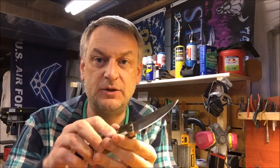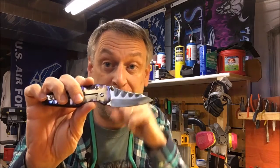What I usually do is I'll take a knife like this one, for example, and I'll use the shape of the swedge here, and I'll lay this down on the steel and just trace around, and I kind of move the lines as I go, right onto the steel with a Sharpie. And if I don't like the way it looks, when you're using a Sharpie on steel, you just take a little WD-40 and it comes right off. And then you move it a little bit, and then you move it a little bit more, and eventually you end up with a blade shape that looks kind of interesting, and that's exactly how I came to this blade shape. And then I cut that out of my blank on my bandsaw,